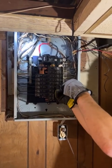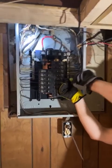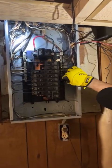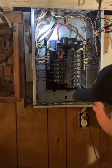You want to make sure that all your breakers and circuits are fused correctly. This is a 12-gauge wire, so you want to be using a 20-amp breaker. You want to make sure they're not over-fused.